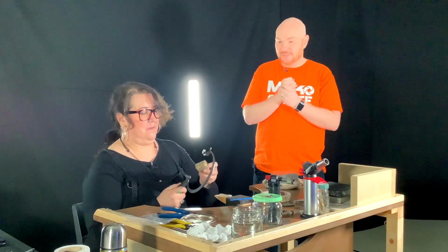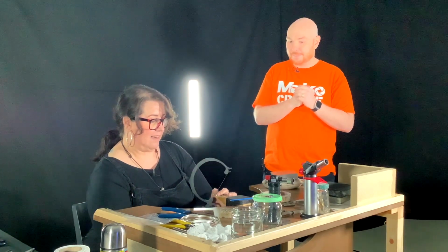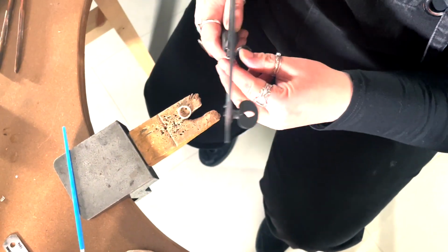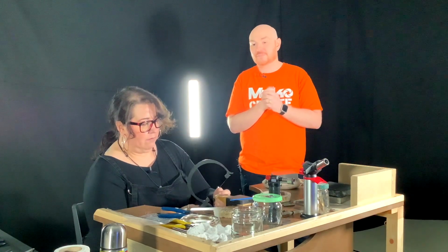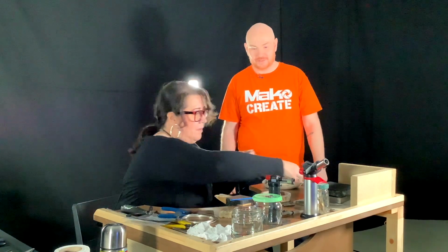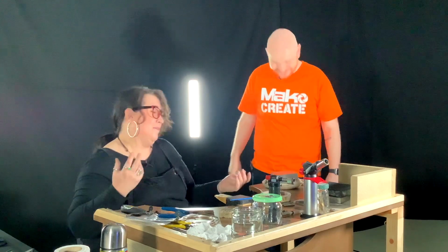Fantastic, that's really good. So we're re-waxing. Re-waxing, nice fresh blade. These blades are so tiny. They snap really easily, and if you catch them in a piece of wire, that's it, they're gone. Okay, we've got a few there. Are the blades relatively cheap for the saw? You can buy really cheap blades, but I don't recommend it. I tend to use slightly finer blades than I probably should, because I like the cut it gives me. We've got our 9 there, and we've got a spare. Good quality blades usually last more, but things happen, don't they?